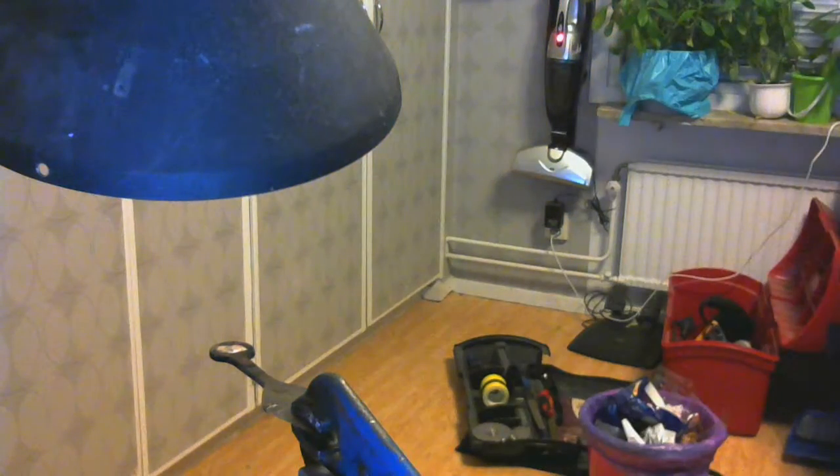And this is a fairly thick piece of steel. It's about 4 millimeters, I'd say. So that's pretty good. Now, to be fair, we didn't have much acting as a heat sink, but it brazes on there quite well, and it flows very well, indicating that anything thinner than this will be like a godsend. So I have another piece, actually, we're going to try it out.